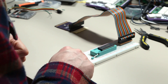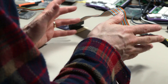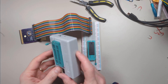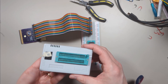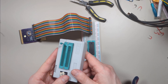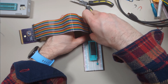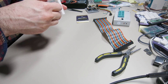I'm also going to use this zero insertion force, or ZIF, socket. It's going to make it really easy to connect and disconnect the flash chip. You can just plug this straight into the solderless breadboard, but it gets a little bit hard with a chip this size to pull it out and put it back in and you can risk damaging it. The reason we're going to need to pull it out is because the way we program this flash cart is using something like this — the TL866 plus — it's for programming chips. This particular model has been discontinued but there's a newer one; I'll include information in the video description, and it just connects to your computer with USB.